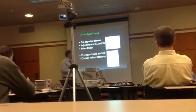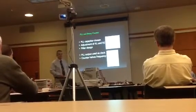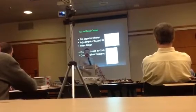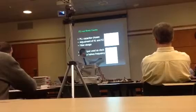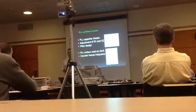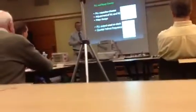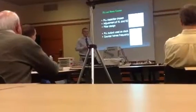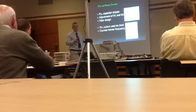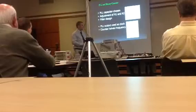Most of the 4-bit binary counter chip's function is not fully used here. All we needed was the PLL signal going into the clock input. Coming out of the Q0 output is a half-frequency square wave going from positive to zero. This is how we generate our 100 kHz signal, which next goes into the filter.